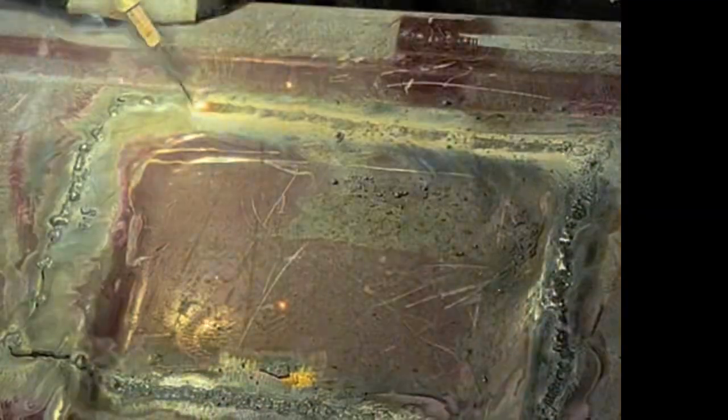And we'll see that here in the end. This is the way I would like to weld all sheet metal, but when you get into the thinner gauges, you absolutely have to stop and let it cool off, or else you're going to have a big oil can and warpage and just a big old mess. But in this case I don't have to slow down — I just keep welding and keep welding until the patch is completely welded solid.